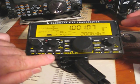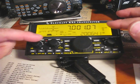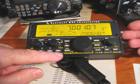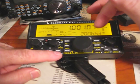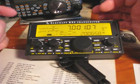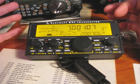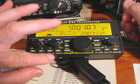The reason I program that key to do that, if I want to check the SWR of the antenna, I put it in bypass. I push and hold the transmit button, which puts it in tune. It sends a 3-watt carrier, and seeing if there isn't anything attached, I can't show you, but it'll give you a 3-watt carrier, and it'll tell you the actual SWR that it sees at the radio. And if it's high, you need the tuner. Push the button, tuner's in line. Push the button one more time, don't hold it down, just tap it, the tuner takes off, and away it goes. But that's what I found for the program function key, the best use.